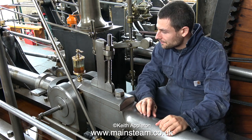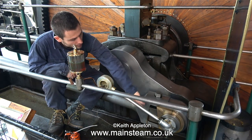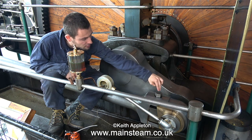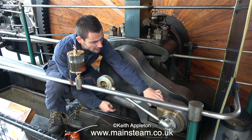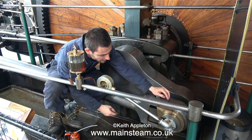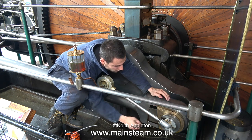Another type of wedge bearing, working the same way as the one I just showed you, is one where the wedge is internal to the main rod end in a cavity and is moved by a set of two screws. It does the exact same thing, and here, in fact, you can see the split line between the two halves and how the wedge interfaces directly with the moving half, which has an angled face.